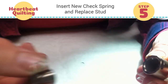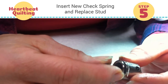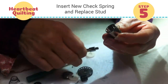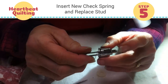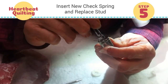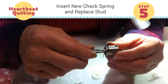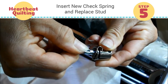We're going to put it back together. We're going to insert the check spring into that slot — the little loose part that makes the U is going to be inserted into the slot. And we're going to put the little rod inside. There's a little slit inside this rod that fits inside the check spring. A piece of that check spring is sticking up and that little rod fits in there. You can feel it when it seats itself — now it's grabbed the check spring.